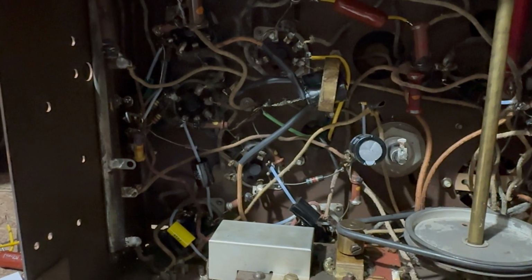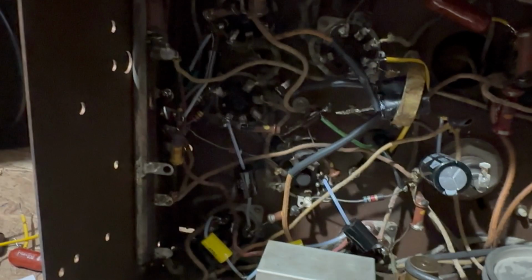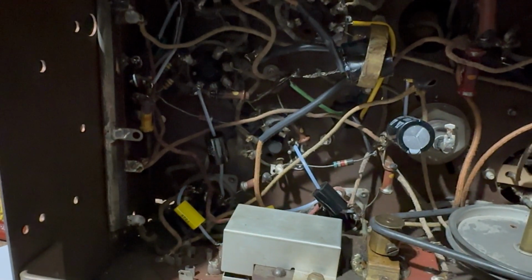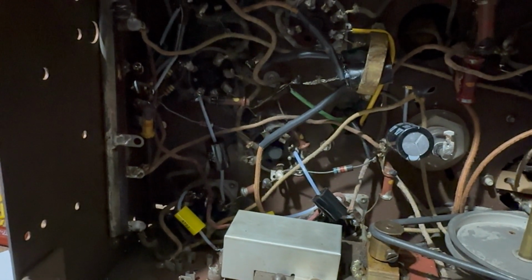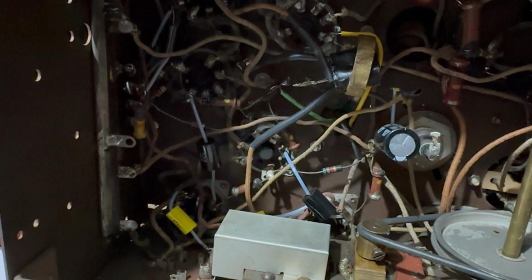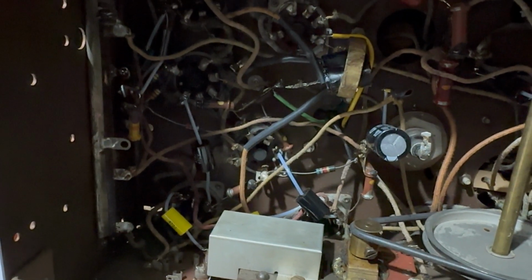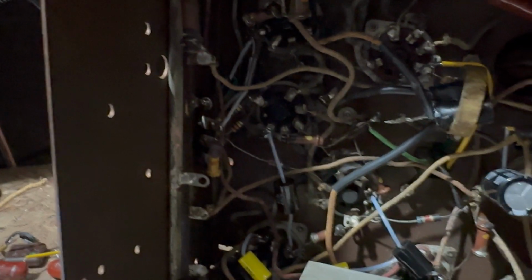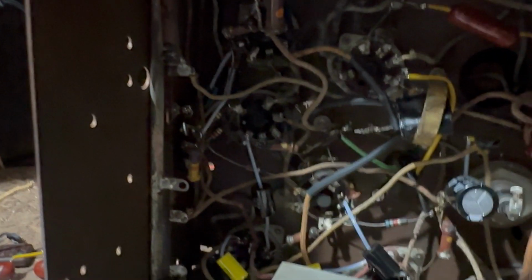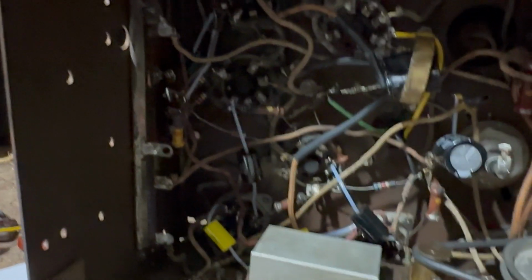Resistors do have a voltage rating, although for radios it doesn't really matter as much in general. The highest voltage you probably see in here is about 450 volts, maybe. But they certainly matter for TVs, and for the CAN dome, which we're going to do next, what matters there is not so much the voltage, but the power rating of the resistor. And there's a chart you can look up, thank goodness, because it would be annoying to figure it all out.